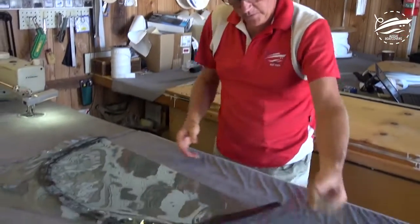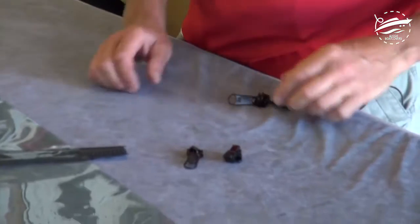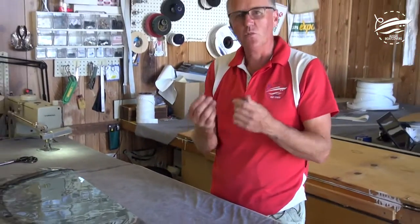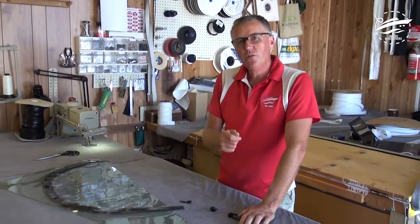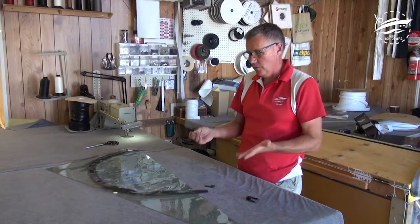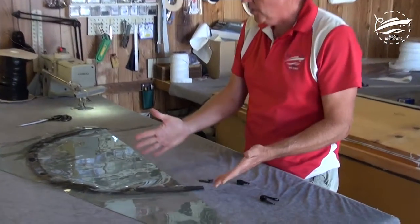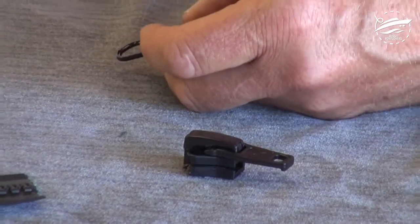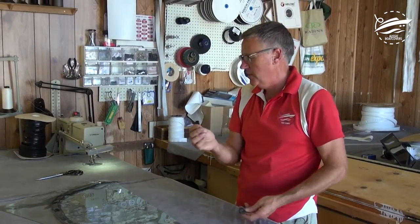The last thing to do is put your zip sliders on. What Pascal offers for the S-Lock zip is three styles of zip slider. These are powder-coated enamel. Some would say you wouldn't use these in a marine situation because of electrolysis — I can't argue that. The reason I do use them is because they're easier to use. This is a beefier, harder zip to use — locking though. So if you're looking for a locking zip slider, this is the one you want to use — it has a mechanism inside there. Each of them are usable in this situation. If you wish to use the double pull, which allows you to open this clear from outside or inside the boat, you have that option. You then have the easy slide action of the enamel powder-coated cast zip, or you have the plastic.